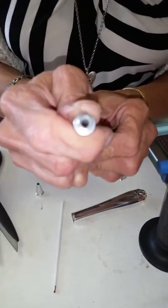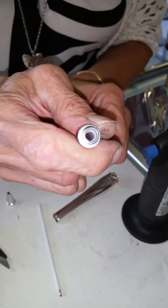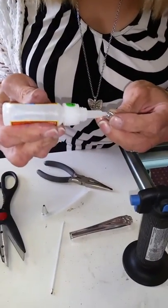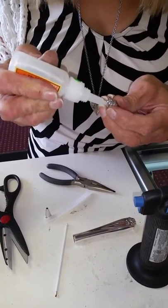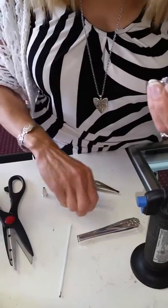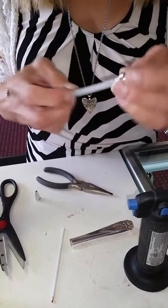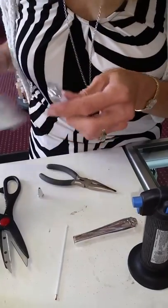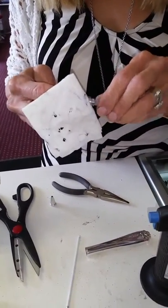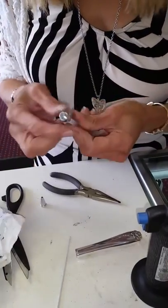But like I said, if your pen refill is a little bit too long and that moved down slightly, you want to make sure you glue it in place there. Okay, after you've test fit everything, you're going to glue the tube inside the adapter for the pen tip. The reason for that is it's not going to be able to be pushed away with use of the pen. If you don't glue that in place, when somebody goes to use the pen over time and pushes on it, the refill is going to push up inside the handle. And you definitely don't want that to happen.